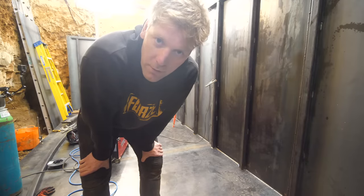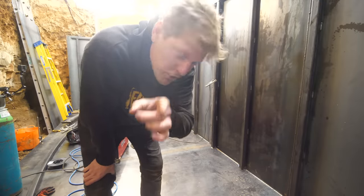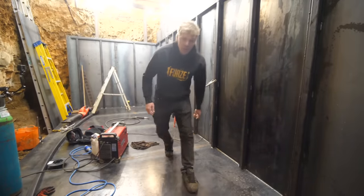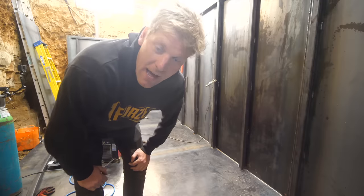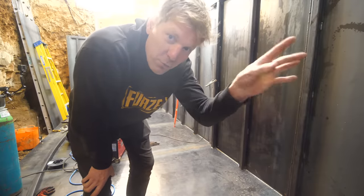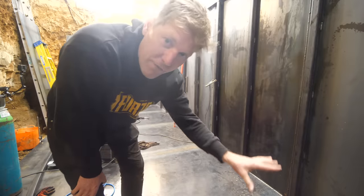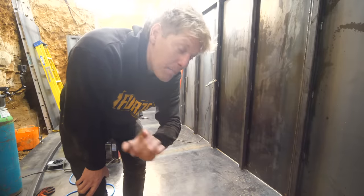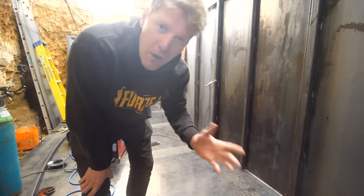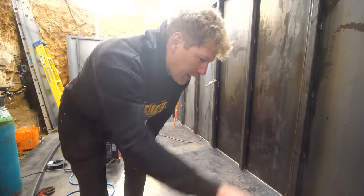While waiting for a delivery from Newark Steel, I did some welding and welded all the walls up - but this has caused an issue. The floor is biscuit tinning now and that is very irritating because it's like working in a blooming drum. Normally what you do with the floor is plasma cut some holes at the end once everything's tacked together so you can reach round and weld all the centre of the sheets to that frame. But biscuit tinning is way more of a pain than a few holes, so I'm going to do all that now.